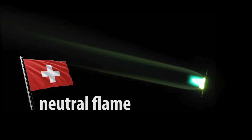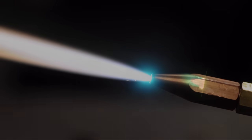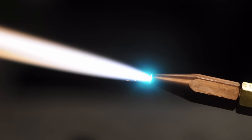Right there, our checkbook is balanced — we have a neutral flame. This is the flame you'd use probably 99% of the time. There's something else going on here you may have never thought about: the flame is conveniently staying put, attached to the tip of the nozzle.